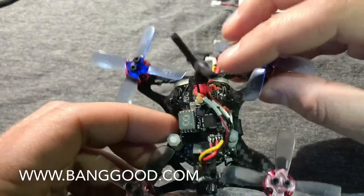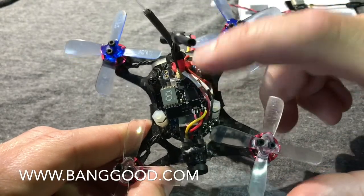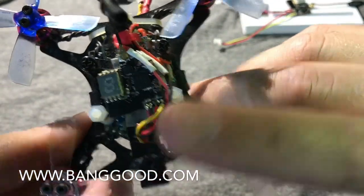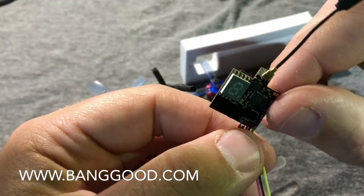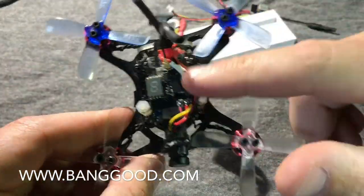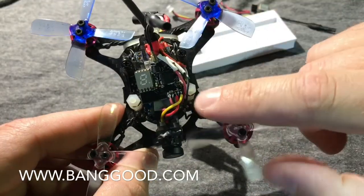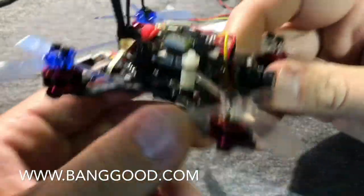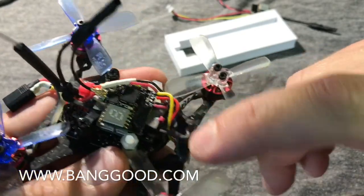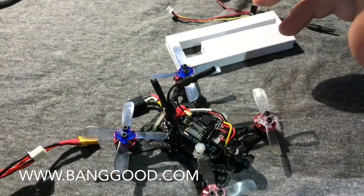There's the dipole antenna right here — I've got it kind of glued or sticky-taped to the top. I ran my power from the 5-volt supply on the bottom of the PDB. I desoldered all the factory wires off and used the existing power lead from the old VTX, soldered this right on. Then I took the camera leads — power, ground, and video feed — and just matched them up and re-soldered right onto here. Stupid simple, stupid easy, stupid quick.